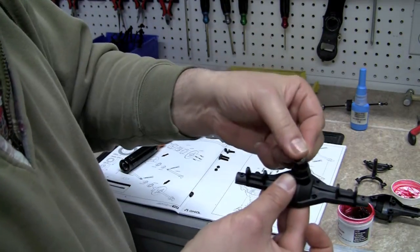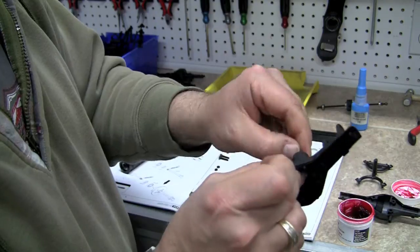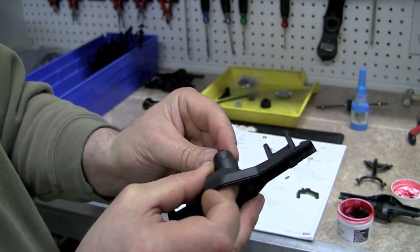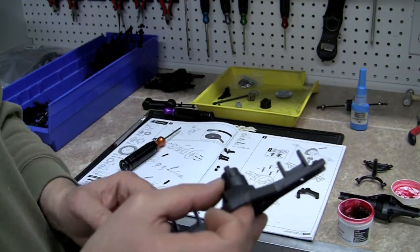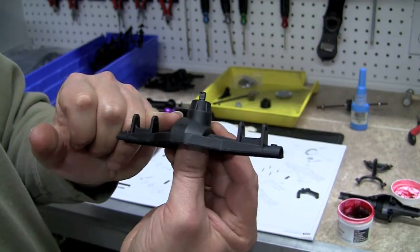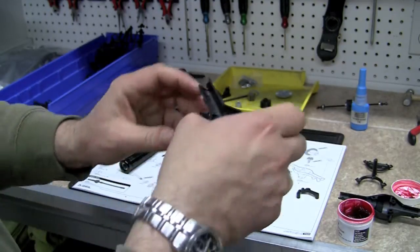Press it in firmly so that the bearing seats. Then we're going to take our second bearing and place it over the shaft, slide that little puppy down until it seats. You are also going to want to peer at the little notch in this shaft — there's a little notch in the shaft. You want to make sure this is pressed all the way through and that the bearings are pressed down so that the little notch is fully exposed and not sunken down. It's actually going to sit up about a sixteenth of an inch. The notch is going to be completely sticking out of the bearing — I had to give it a really good press with my thumb to get it to slip all the way through.